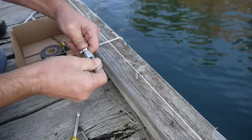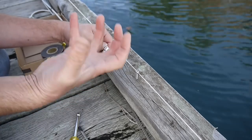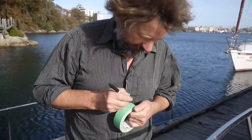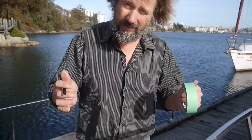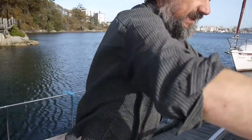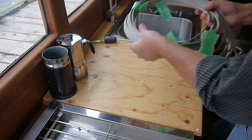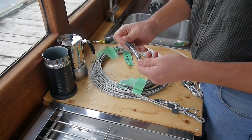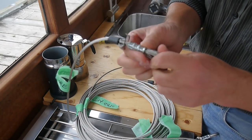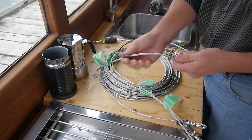When I lived in Lunenburg, Nova Scotia, I knew a rigger that spent all his days splicing wire rope much heavier than this stuff - and his hands were just unbelievable. I also need to mark these cables so as I start to pull them through, I don't get frustrated because I've got the wrong one in the wrong place. Back from my local chandlery and I've had all the crimps done on these swages - it's quite beautifully crimped. So now I'm just going to take off all these hose clamps and shrink the shrink tube.